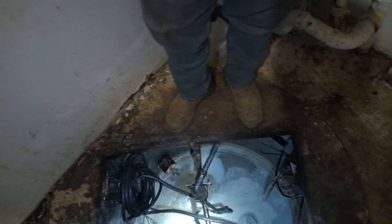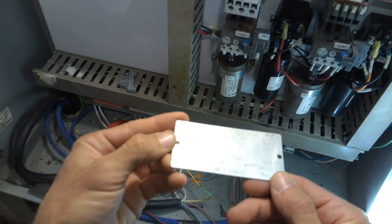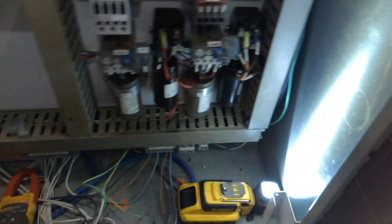Oh, they're on rails — nice. Those are the smallest rails I've ever seen. They look like little model pumps — like how they make model trains. Is this the new one? It was sitting right here, cool, looks shiny. Single phase, 60 hertz, 230 volts — perfect. Just making sure it's a single-phase motor you guys put in. I trust you, but I like to check too. Don't assume anything.